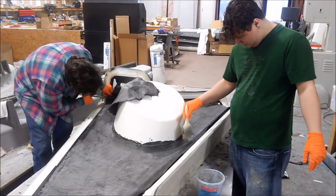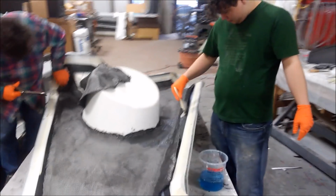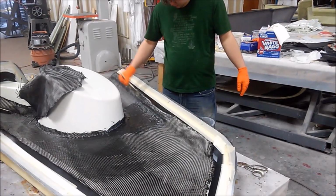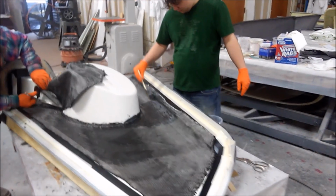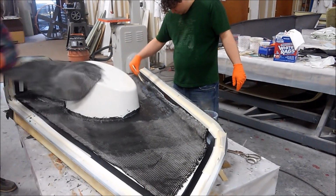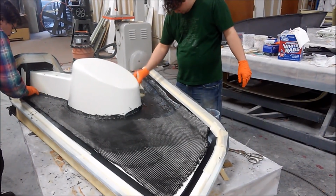And so now it's time to start laying up the Strake skins. So this is the first one of the lower skins, as you can see there, with the wheel well in place. And what Jeff's gone and done prior to this little bit of video is he's primed the inside of the mold. So it was obviously waxed in preparation, and then he just sprayed the white primer in there, and that's what you can sort of see there on the wheel well.